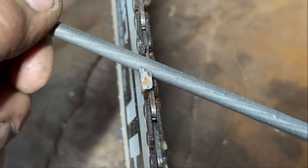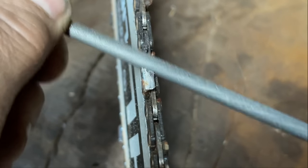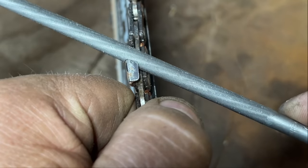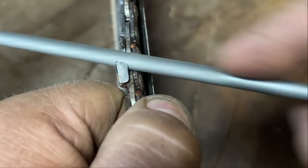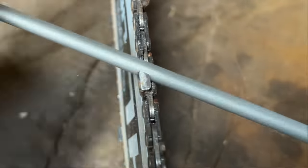Friends, this is something that takes a while to get onto, but it really is the only way — just get on it. You're going to destroy a couple chains off the hop, well not destroy, but you'll be pretty funky in the beginning if you're just starting. I urge you to file both ways — don't flip the saw around. Just get comfortable filing with your right hand across, then put the file in the other hand and start pulling and pushing with that hand. Train yourself to do that — you will thank yourself down the road, and it won't take long. Address your work, look at all angles of the chain — turn it, look behind it, look down on top, look underneath.